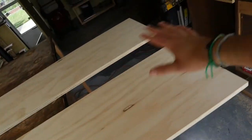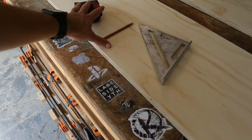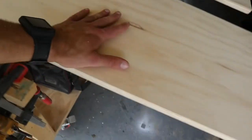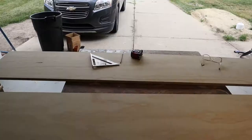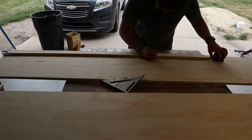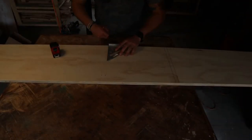Now that we went full super pro on getting these to 7 feet tall, I'm going to use my handy-dandy tape measure, pencil, and straight edge to measure out the 30-inch mark, the 15-inch mark, and such, all the way up. If you ever do something like this, make sure you account for your material thickness. For example, my first shelf starts at 30 inches up, but it won't end at 30 inches — it'll end at 30 and 3/4 of an inch. So if I want a 15-inch gap, I've got to take 30 and 3/4 and add 15 to get 45 and 3/4 inches rather than just 45 inches. A helpful tip.